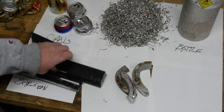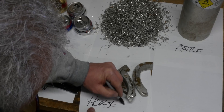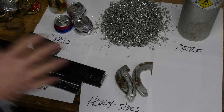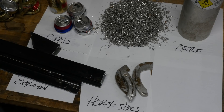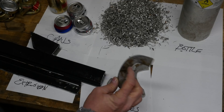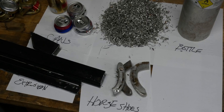Horseshoes — who knew horseshoes came in aluminum? Some of them do. So those are the five things we're going to melt. We're going to take the starting weight of all these things, melt them, make ingots, weigh the ingots, weigh the dross — the leftover stuff, anything that comes off the top or out of the bottom of my crucible. All that's going to get weighed up and we'll know how much yield we got. I've got some cleanup to do — clearly I don't want to melt the nails in the horseshoes. I might even want to clean the horse manure off of them too.